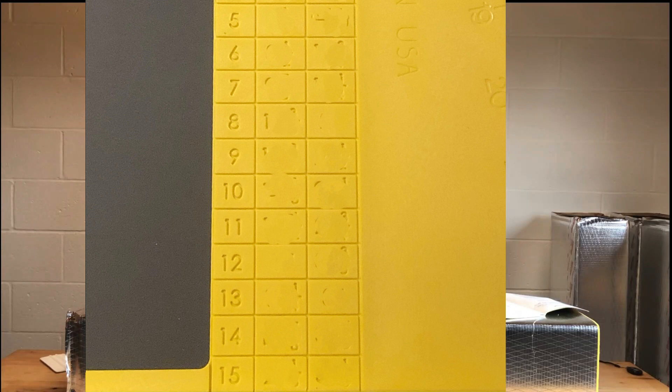If you need a sharper, larger offset, you can always add the two offsets together to come up with a larger number. For example, for a 5 and 15, you would add 21 and an eighth and 7 and an eighth, and that would be your offset.